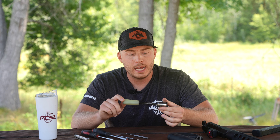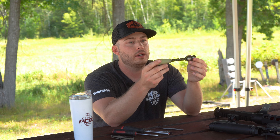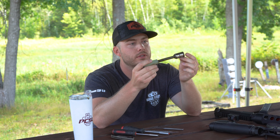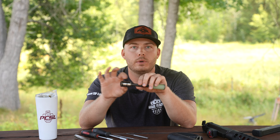...the spring comes at the 85% rate, painted black on one side. Also note the long nylon piece at the bottom — that is a pre-short-stroked system, so it only compresses to a limited travel distance. On other silent capture springs this piece is a lot shorter, giving more bolt travel. I've experimented with extra spacers in the bottom, a wave spring for extra compression, washers to further reduce travel, and adding or removing weight from the silent capture weight carrier — even removing both weights and running just the carrier.